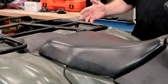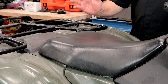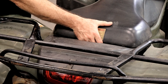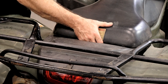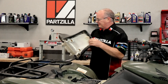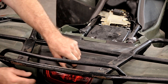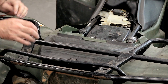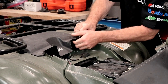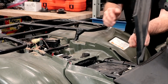For those unfamiliar with the Honda TRX, they're really easy to get to your critical parts of the machine without any tools. The seat — you just simply reach behind and there's a little tab, or actually an arm, that you lift up, release it, and then it pulls away. Now to really get access to where all the electronics are, we want to drop the rear tail section. Lift up on the front edge of this cover — it's just held in by a couple of grommets — and slide it forward, then it releases.